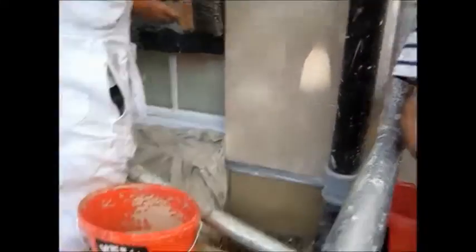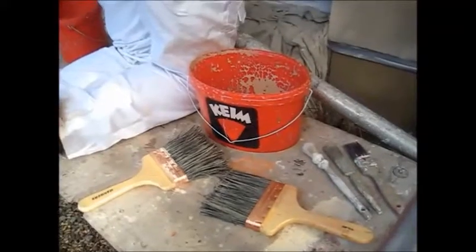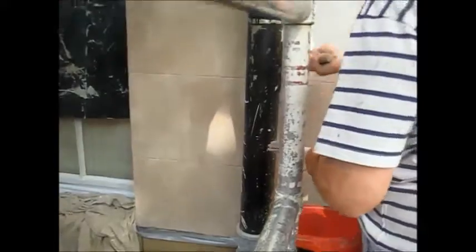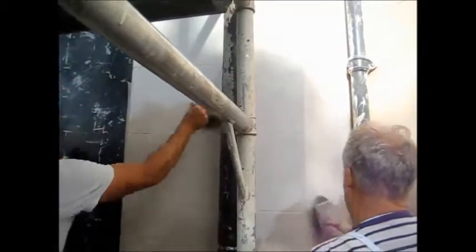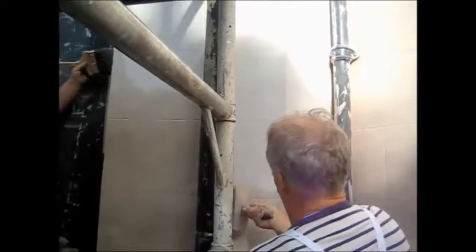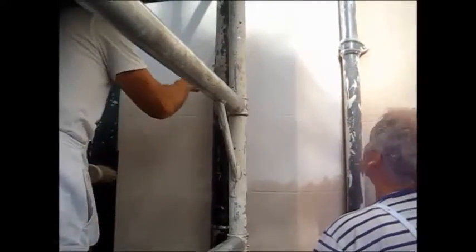Wet brushes, but I've got a couple of dry brushes handy just to take away any runs. Stipple them if they've started to dry so that you don't overlap. The break point for this will be into a corner, not on an obtuse corner, into an angle.